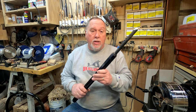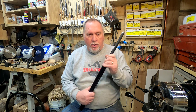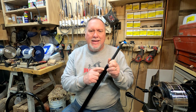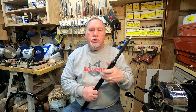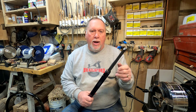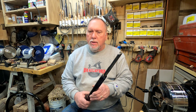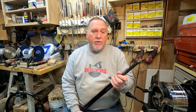This has been a great tool and I do love it. I will say, even though the blade is removable from the handle, it's not convenient to have to take an Allen wrench, loosen it up, pull it out, and sharpen it — especially if you're doing a bowl out of, say, pecan, and you're sharpening 5, 6, 7 times in the matter of a turn. It's just not convenient.